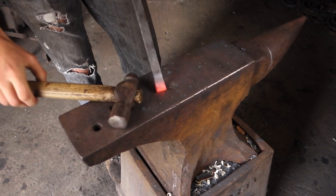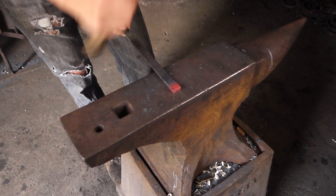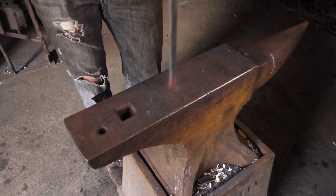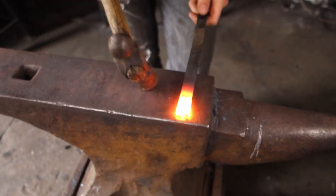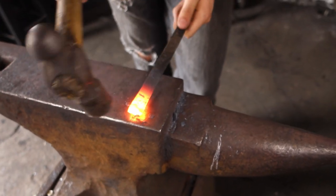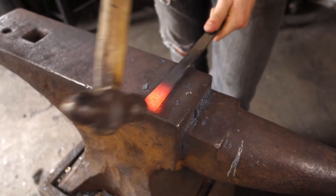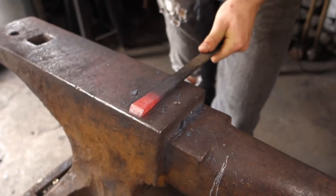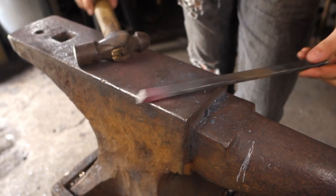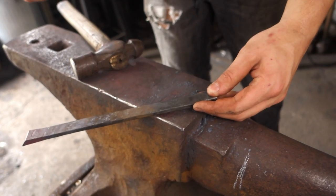Just so I don't mess it up, because I'm then hammering on it — upsetting the other end. Both ends have that upsetting. I'm just going to put a little scarf on here, so we can bring those seams of the weld together nicely. I'll do the same on this end now and then we'll twist it to make it into the Mobius strip.